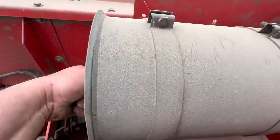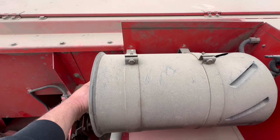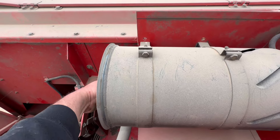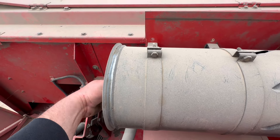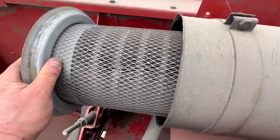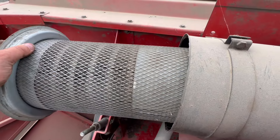Let's have a look at that air cleaner — turn this wing nut on the end here. These want blowing out every single day of the week because it's a very dusty and mucky environment, and the engine wants to be running as well as it can. Oh yeah, it is a bit mucky, look. I'll get it over and get it on the wash bay. What a massive air filter.